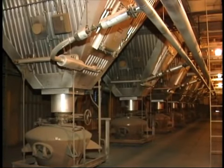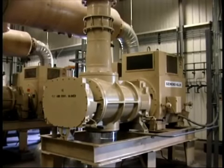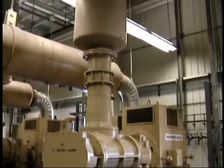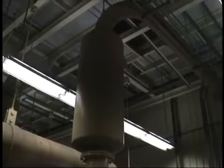Actually, only 40 to 50% of the ash forms bottom ash. The remainder, as fly ash, passes on through the boiler to be removed from the hoppers of dust removal equipment, such as the precipitator. The fly ash system actually works under vacuum that sucks the fine dust out of the hoppers and conveys it to the storage silo for eventual disposal. Because of the relatively large quantity involved, fly ash from coal can cause serious problems due to deposits, fouling, and blockage of gas passes between superheater tubes.